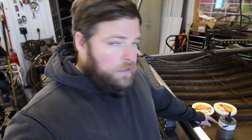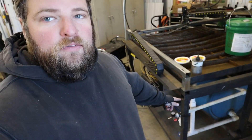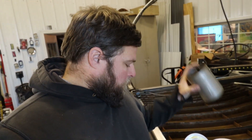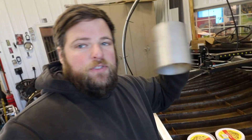First off is the drain for my pan. As you guys know from my past videos, when I put in this gravity fill system for the water, the pan doesn't actually drain completely. So what I'm going to add today is a sump for the water pan, which is just going to be this 4-inch piece of exhaust pipe. I'm going to use this 4-inch hole saw to cut the drain out of it, weld this piece to the pan, then weld that cutout with the shower drain into the bottom of that piece of exhaust tube. That way the whole pan will actually drain.